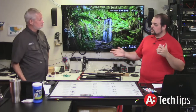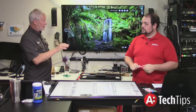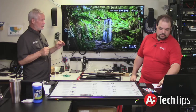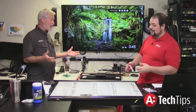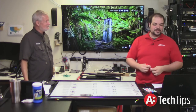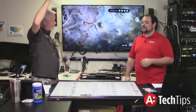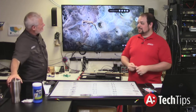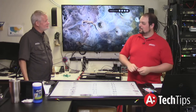We've covered tips, tricks, and different ways to do the installation. On installation: guys love to use impact drivers because they're simple, but I'm not a big fan because it's easy for them to over-torque and actually bend the frame and cause deflection. It's like putting ceiling speakers in — if you over-torque a screw on a ceiling speaker, that flange is no longer symmetrical. I back the clutch off slightly and go in that way.